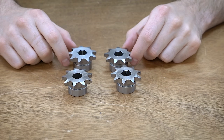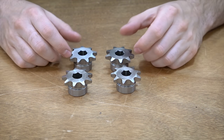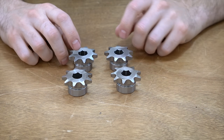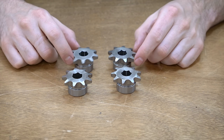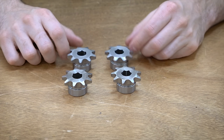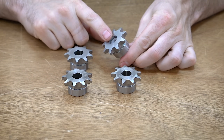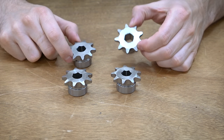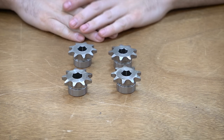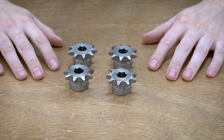I'm going to go do the others — I ended up doing four of these and I'm keeping the other two with a plain bore for now just in case. Overall this is pretty easy to do if you already have a hex broach and a hydraulic press. A hydraulic press is definitely a great thing to have. This is about the same level of effort as doing a keyway but it's a much better mechanical fit with a hex shaft. I would much prefer this over a keyway, and hopefully this will help with the sprocket splitting issues. Thanks for watching — check out my Facebook page and the Copperhead page for updates, and I'll see you in the next video.